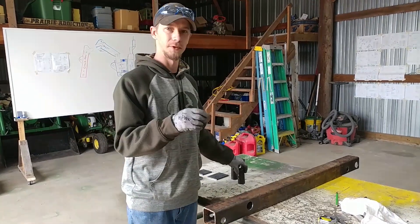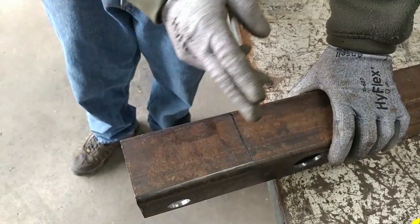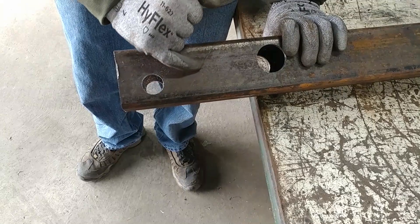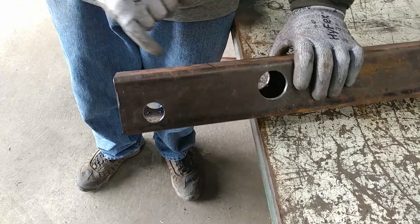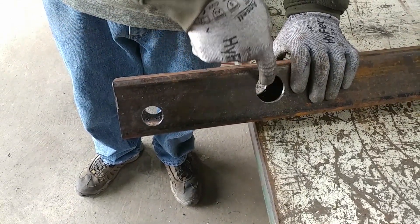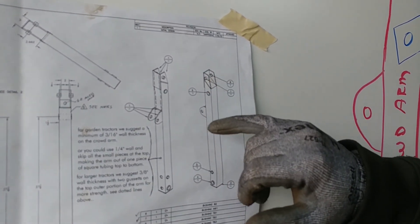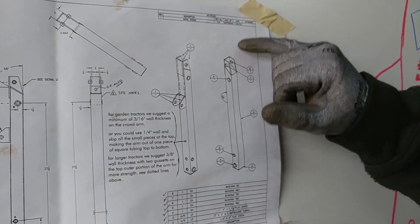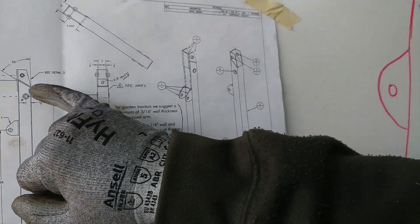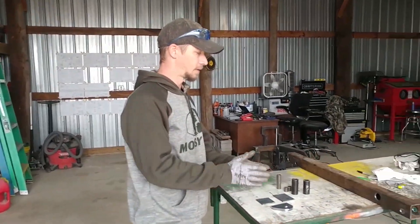The plans explain the upgrade option in the letter included. So this little metal piece we have to cut out — we're going to weld it on the inside. There's a hole drilled in it so we can access the grease fitting that runs the bushing on the inside. The blueprints confirm: if you upgrade, you can do it as one piece instead of those little brackets. So we're going to cut that piece off, trim and get the angles we need, then weld it all together. That's all we have left — cut that one piece and get it welded.